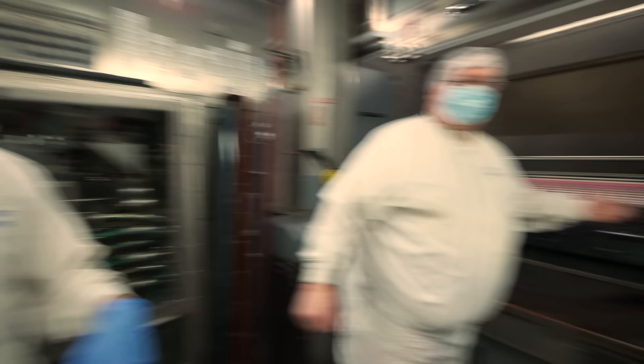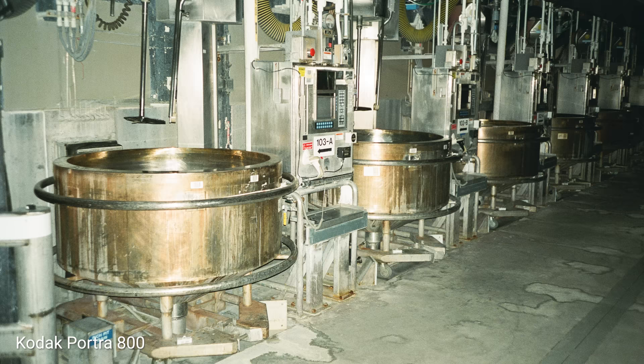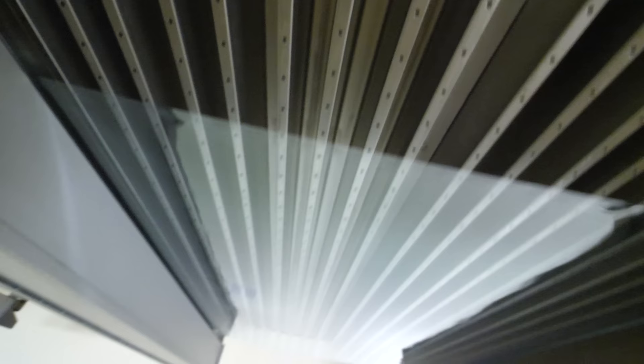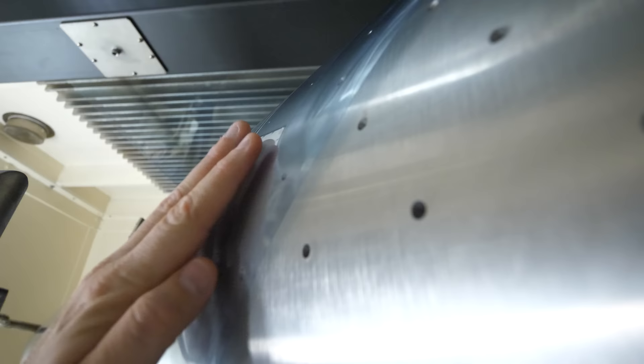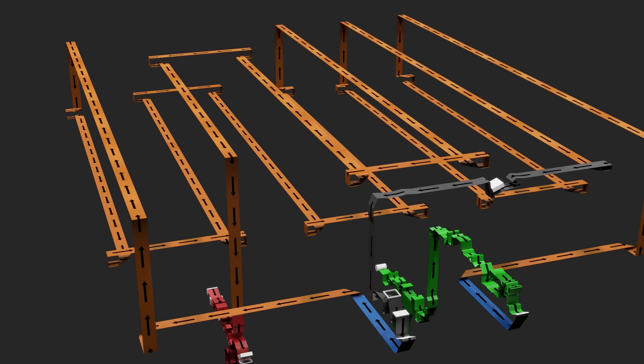In the second video, we took that wide roll and applied a light-sensitive coating to it with a laminar flow waterfall — I kid you not. They actually apply multiple layers at once with this waterfall, and they make the layers in special kettles down in the basement. Everything is happening in the dark. After they apply the coatings, they have to go dry it over about a mile of conveyance, still in the dark, moving the film with air. They use nineties-era robots to move stuff around. It is a technological marvel.